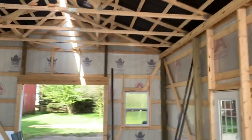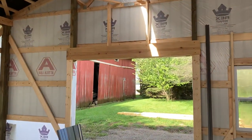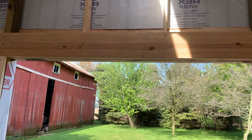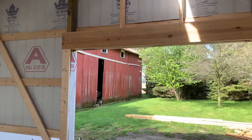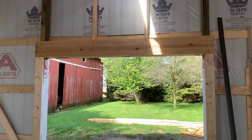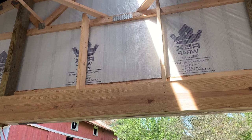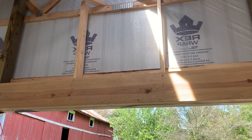Let's go over here — I want to show you the overhead door on this building. You can see you've got a two-by-twelve, because what you want to watch out for is sag. This is not a wide span here, but on a wider span you've got to be careful about sag on the overhead door. See what these builders have done — those two two-by-sixes run right against the bottom of the truss, giving it that extra support so you won't have sag in the metal.